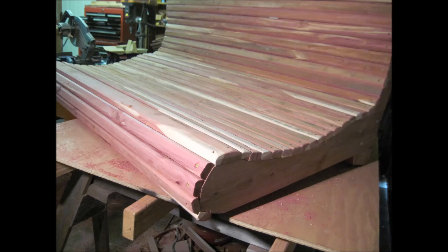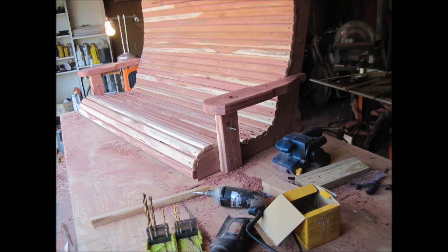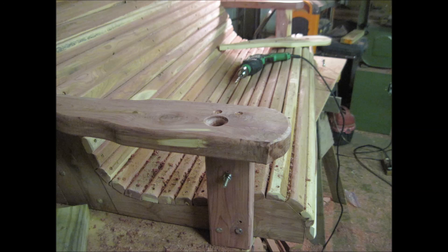There are pretty good pieces of wood there. After I figured it out, you've got to get it all squared up before you try to put the curve on it or put those lap joints in — you need to square it up. So there you are with the pieces already on there, and there's the back of one of them. I used a table for jigging it up. I'd just cut all the pieces the same length and drill all the holes. I had a jig set up for drilling the holes in those slats so they'd all be in the right place, then countersink them all so you don't split them, because that cedar will split on you. And then drill the holes for the chain to come through.